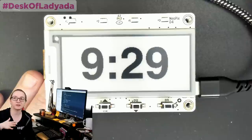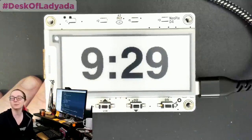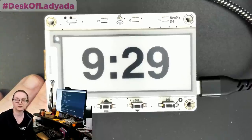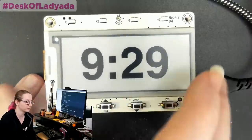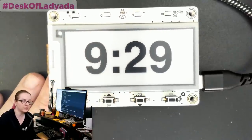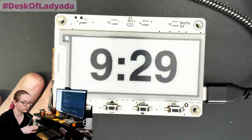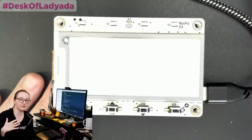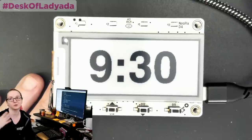Deep sleep is not in CircuitPython yet, but it's coming very soon. We're still working on the API and we're going to add deep sleep mode. Arduino can do deep sleep, but Arduino also is having some weird issues as they're updating the IDF. So that's why I suggest CircuitPython — even if you don't get deep sleep mode, you can at least get your design programmed in. I'm going to design a 4.2-inch version next. The 2.9 was just to get started because it felt like a very comfortable, small credit card size. But I want a 4.2-inch one because I think that'll look really cool. Even though it's a bigger display, it doesn't take much more power to update because it's still a static display — you update it and then you go to sleep.